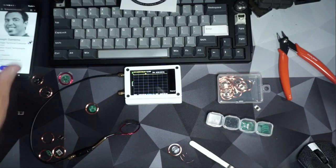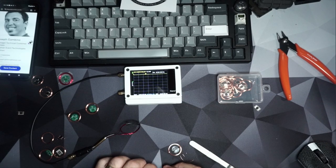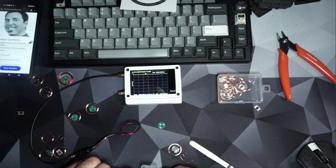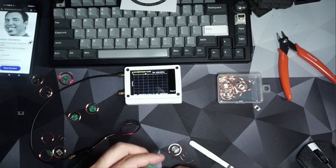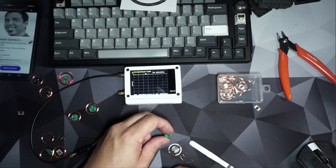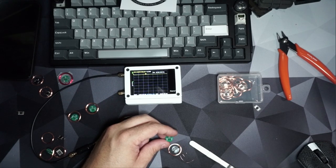Hope that's helpful. The ones I'm giving out are not going to have the antenna on them — it's just going to be the raw PCB, so you can use your own antennas and do whatever you want with them. It just makes soldering those tiny SMD capacitors much, much simpler, and it gives you an easier way to attach the antenna and then tune it manually.